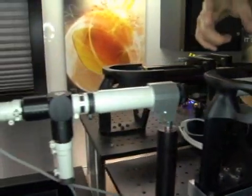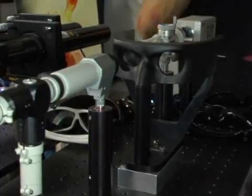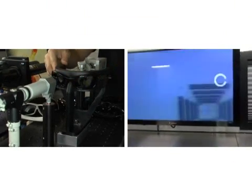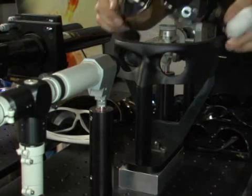At the same time, you don't want light over here to be overcorrected, so what we've done is tapered it. Coming from the optical center, it gets thinner and thinner going out in every direction from that center, which allows the lens to be rebalanced. No matter what direction light hits this lens, it goes through a straight natural path. With this scope, we've created 35 feet of distance using a series of lenses. Our goal is to see that target as clear and as defined as possible — for the highest levels of ANSI testing, 20 lines of resolution. This is our first material, glass — typically thought of as being very optically correct, but not always the case. Second material is CR-39, the most commonly used material in sunglasses today, from mid-range all the way up to your highest-end fashion brands.